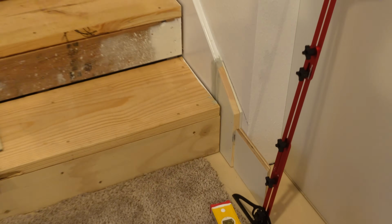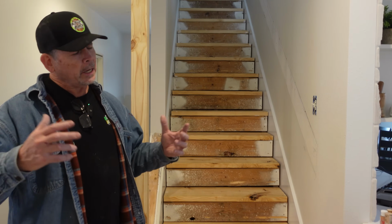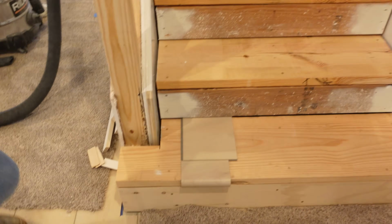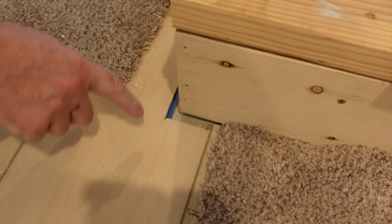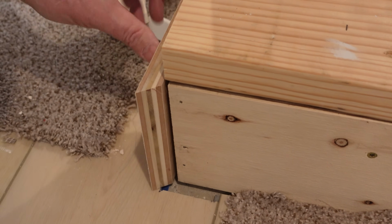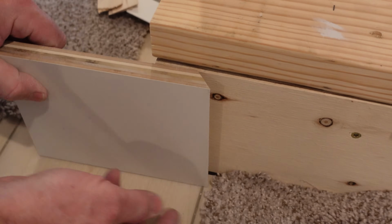Now, on our risers, we actually bought 3/4 inch plywood. I know what you're saying. Stud pack, 3/4 way too thick. 1/8, quarter, half is plenty. It's all you need. But here was our challenge. We had to cover this gap right here. I don't want to change this board. I can, but I don't want to. So if we use 3/4, it perfectly covers that in both directions.